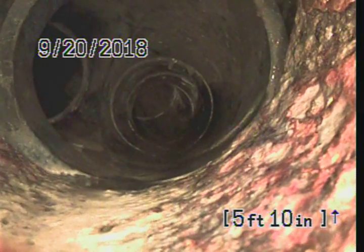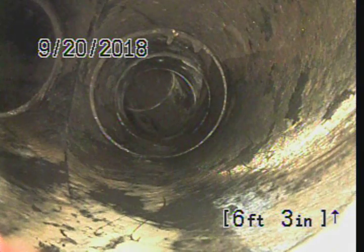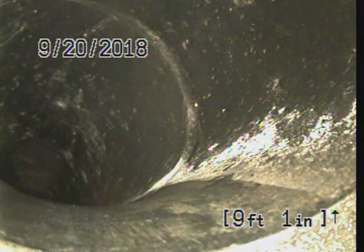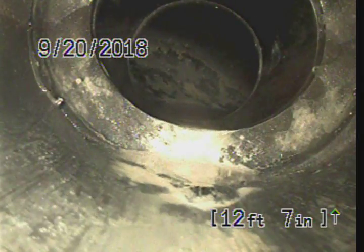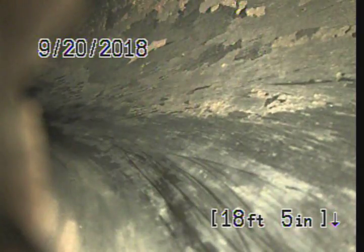It's just a small piece — actually only about a four-foot piece. Then it's going to transition from four-inch cast iron to ABS. They've done some work underneath, and then this picks up a little bit of another transition on ABS. There's a really small piece of cast iron, and then we have a bushing — a four-to-three inch bushing it looks like — and then we're back into ABS again, which is good. There's a little bit of an elbow there at about eighteen feet.